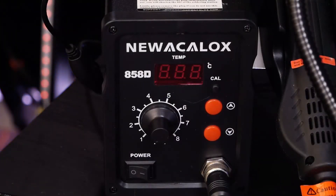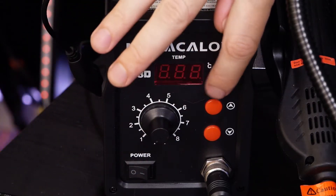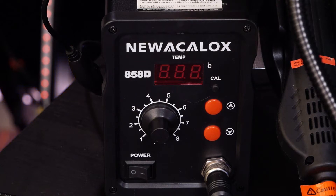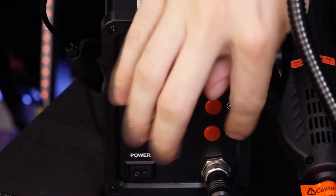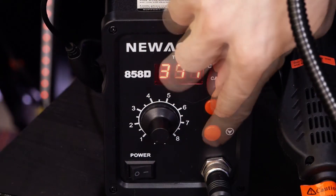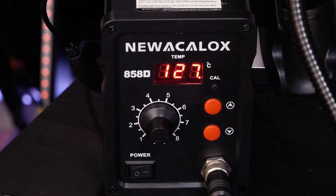To get started, we're going to need to melt the solder with a little bit of heat, and for that we're going to use a heat gun. The one I have is relatively cheap, and it also allows me to adjust both the temperature and the airflow. There's a knob here that I can move back and forth to adjust the amount of air that flows through, as well as an up and down knob to adjust the temperature, which I can run anywhere from around 315 degrees Celsius all the way up to about 400 degrees, which is about 700 degrees Fahrenheit. This is kind of like a soldering iron — you want to apply only the necessary heat. So when we turn this on, you can adjust the temperature by pressing these buttons, and I'll be able to use the hot air to start melting solder.